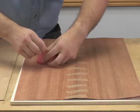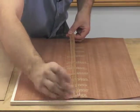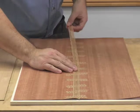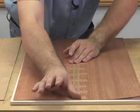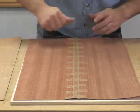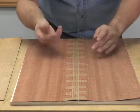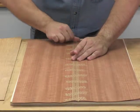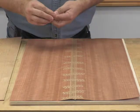Just wet the one end and run it through on a wet sponge. It kind of feels like wallpaper — you know when you touch wallpaper with wallpaper glue on the back. If you didn't have the holes in the tape you could actually miss the joint line by a lot and not even notice. They also have another type of veneer tape that's more like normal tape — the back is already sticky and you just lay it down, but it sticks too well and it's hard to get the residue off. You have to take that tape off fast after veneering, whereas this type can be left to dry for days. I sometimes had to use lacquer thinner to get the residue off and eventually decided it was not worth the trouble.